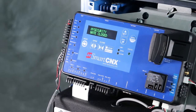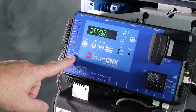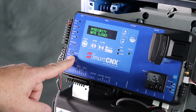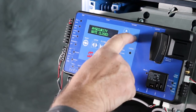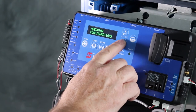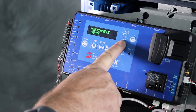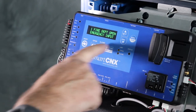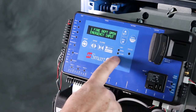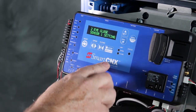The next thing to do is to make sure that it's programmed correctly. We're going to go into the sensor menu and make sure that sensor one is configured for PhotoEye close. We hit menu and then go into programmable inputs, hit select, and navigate to sensor one with the arrow keys. There is sensor one — it's a programmable input.